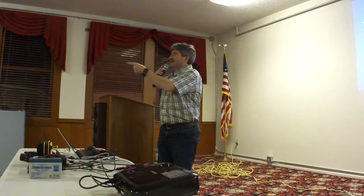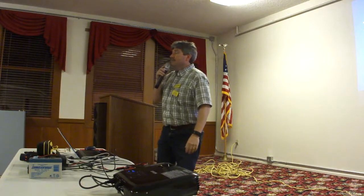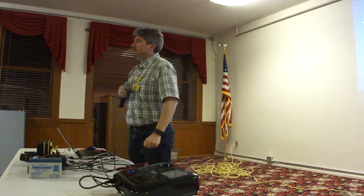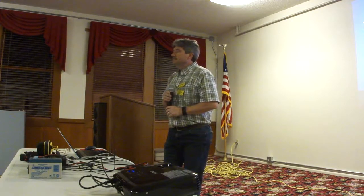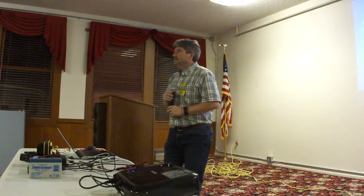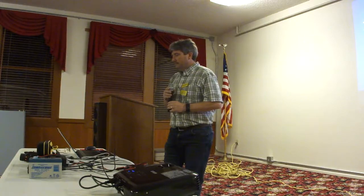Anything on VHF or UHF? Yes, I haven't played there. There are frequencies in the weak signal area, and then there are also frequencies where you can work these over FM, if all you've got is FM and you want to play around. You don't get the efficiency of the digital over FM, but you can get everything checked out, or let a tech get their feet wet playing with this on FM mode. But yes, there are frequencies also in VHF. So VHF would be assigned? Normally, yes. It would be in the weak signal mode area. There's a digital subband in there.